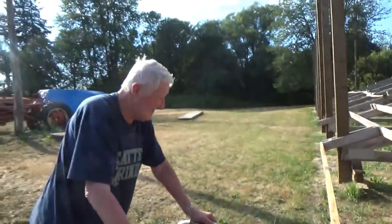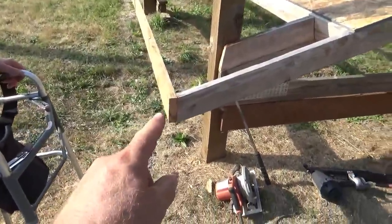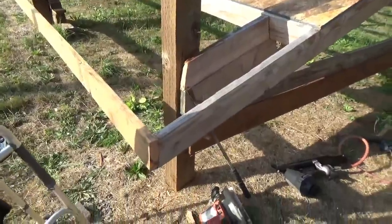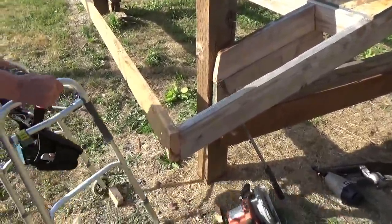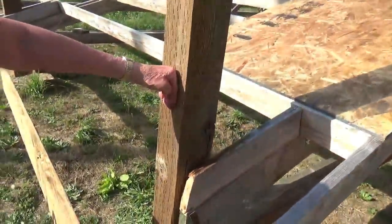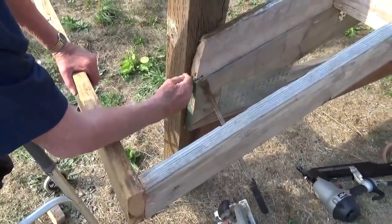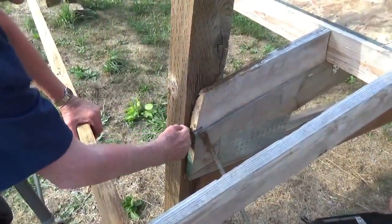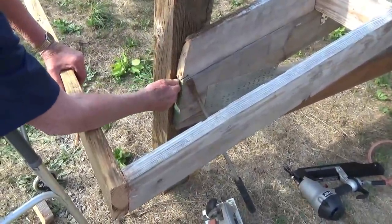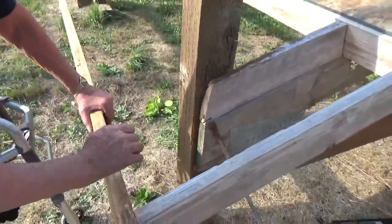Okay, basically what we have here is a square corner that we worked on. And everything comes off that column. So, first thing you need to do is establish that the face of the column is where everything comes in, okay? So when this is raised, this here will line up with this face here, okay? There'll be a girt that comes across here from here up. And that'll get nailed into here and down there, okay?